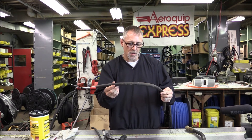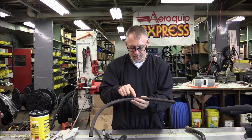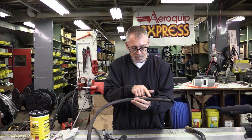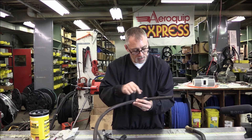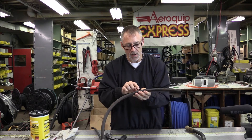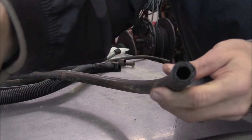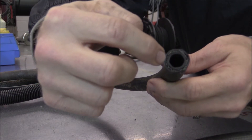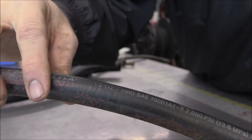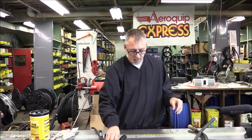This one is a Goodyear hose. It's half-inch, 12.7 millimeter, SAE 100R1 AT-8. 8 over 16 is half-inch. 2,000 PSI working pressure, flame resistant, USMSHA - Mining and Safety Health Association, good for being used in mines. It says 2G-14C-12. We're looking for the 100R1 AT, something that tells us it is a one-wire hose. This particular one is cut, so we can show you: single-braided steel braid, tube and cover. 100R1 AT can be replaced with GH-663 or my favorite, GH-781.